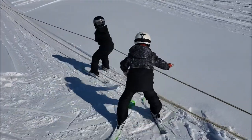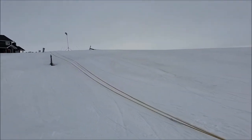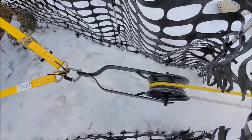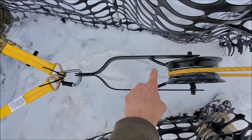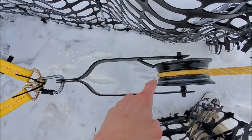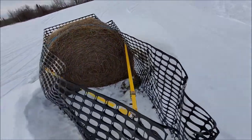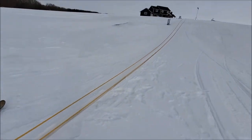I wanted to show you the pulley at the bottom. We had some issues with the pulley basically falling off when someone would grab the rope too hard — it would make it jump and pop off the pulley and get stuck. So what I did was weld these two little pieces of half-inch steel bar, bent them a bit and welded them in place, so if the rope ever falls off it just gets pushed back onto the pulley versus falling off the edge and causing a problem. We still use hay bales as you can see, but you could also use a frame, some screw piles, or strap it to a snowmobile — really anything to hold it back works just fine.